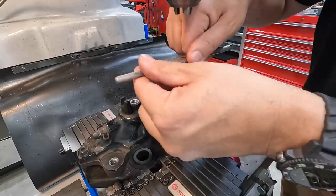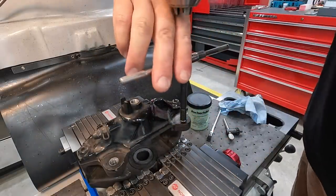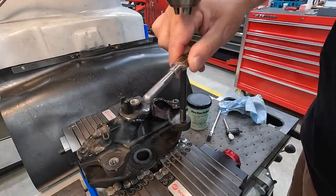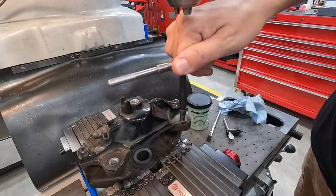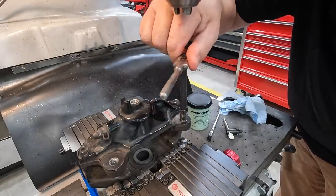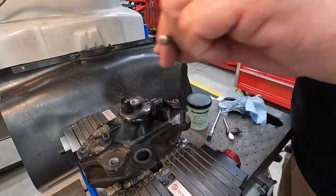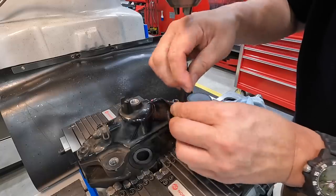All right, we're just about in there. So you want to make sure that very last bit of the coil is at least a quarter to a halfway down in the first thread. So it just went under the surface there. So we're going to go another quarter turn right there. All right, just a touch more, just like that. That looks pretty good. And we'll unscrew it.